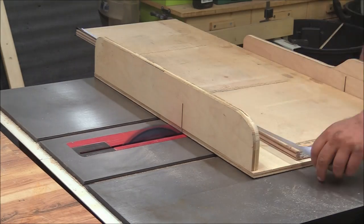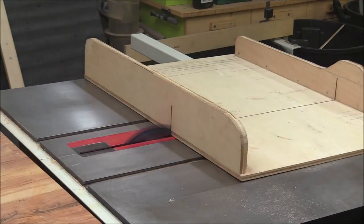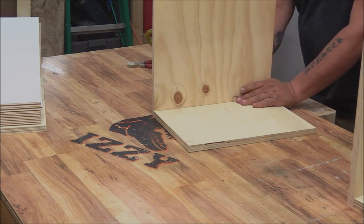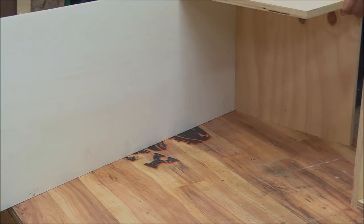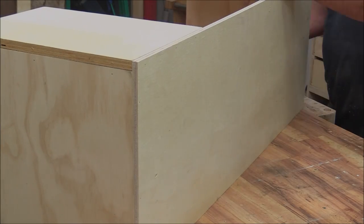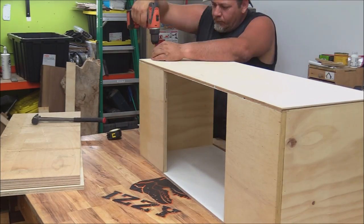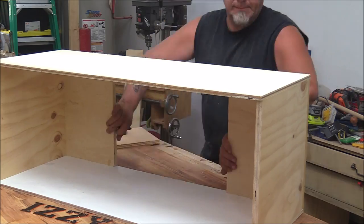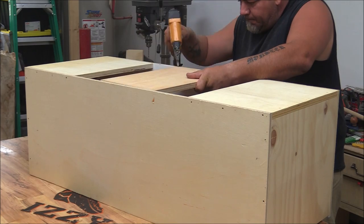For the box I could get away with using frames if I didn't have enough full sheets, which is what I ended up doing. I wanted a full sheet for the back of the box but there wasn't enough material, so I made L-brackets and screwed those to the sides of the box where the seats sit and the table floats. After putting those L-brackets on the two pieces of half-inch plywood, I needed to put a center piece in because the tabletop rotates on top and that's what holds the wings up when installed.